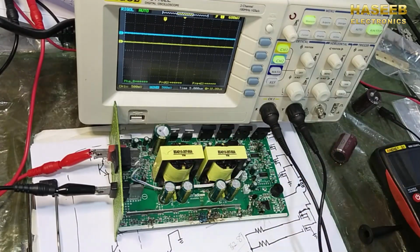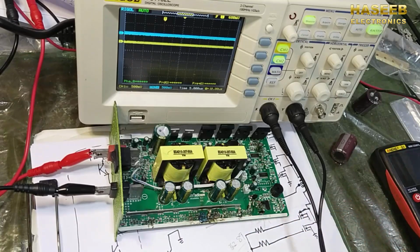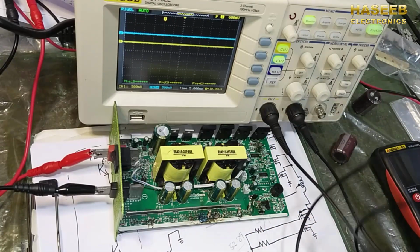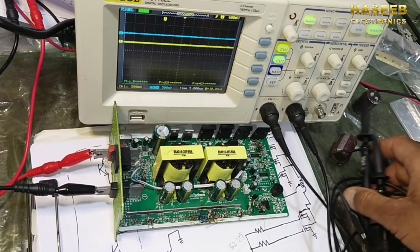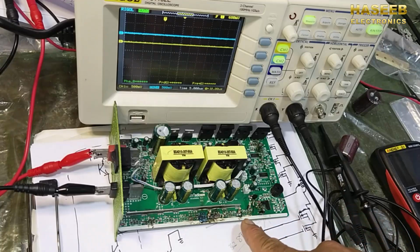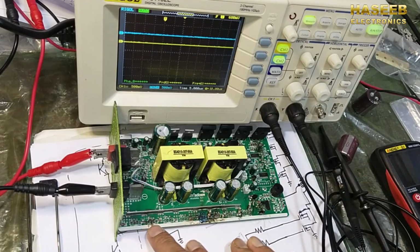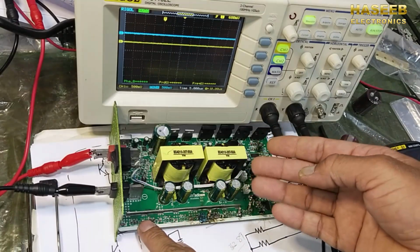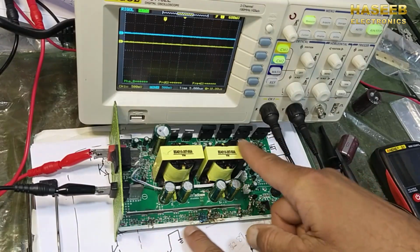Before replacing with new MOSFETs, new IGBTs or new transistors, we must ensure the gate drive signal. Otherwise, if we install without checking the signal, that will damage the MOSFETs. And we have to ensure the gate discharge signal. If the gate discharge network works properly, then the MOSFETs will work properly. So these are the basic requirements for good function of the MOSFET. In our next session, we will install the MOSFETs here, and then we will test the output, and we will complete it in our next videos.